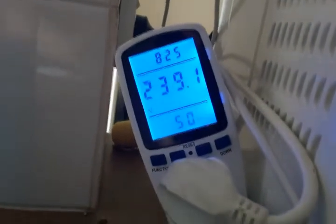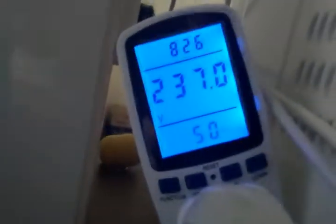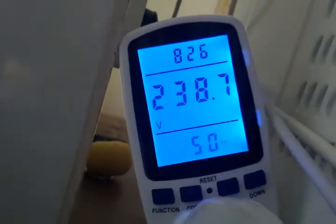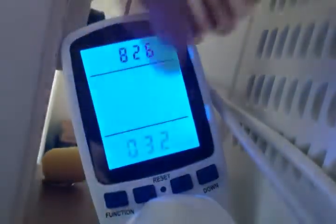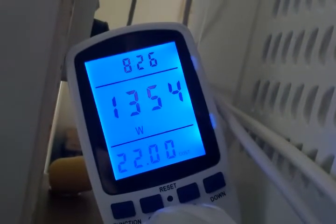It's running right now, steady 240 volts. I'm going to run this microwave — apparently these are the hardest things for a generator to run, kitchen appliance wise. Pop this one on, see how it goes. It kicks off straight away — look at that, no frequency drop. Voltage did drop, but not by anything crazy. 6 amps, 240 volts — 1300 watts out.